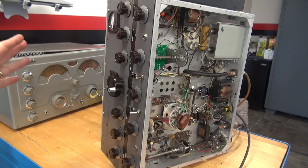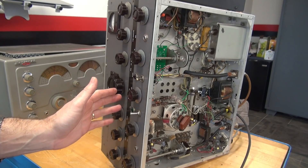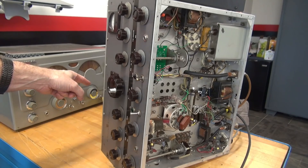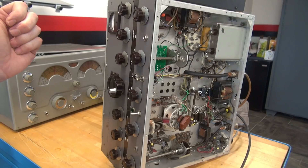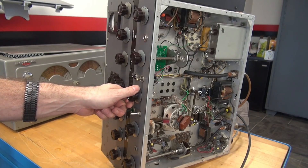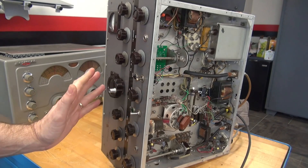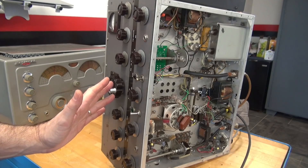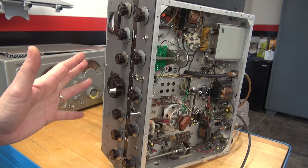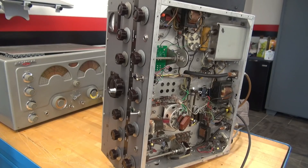At this point I'm not transmitting. I'm just going to take the CW/phone switch, go to CW — that's when you would spot on your receiver. I have a VFO hidden back there, and we have the DX150B monitoring. So listen — hear that? I thought that's pretty crazy. But then I thought, wait a minute — I don't have the bottom cover installed. So maybe that is letting some RF dance around in here. Let's put the bottom cover on.